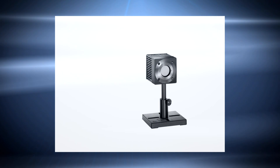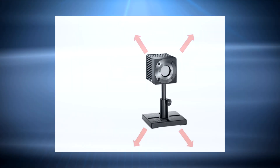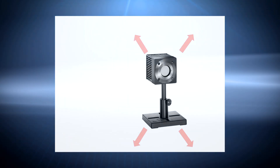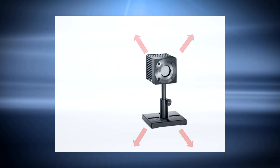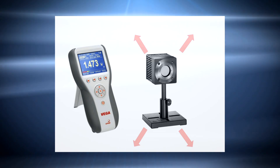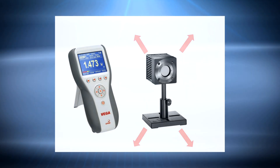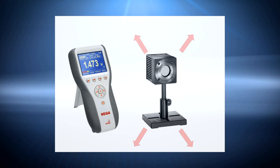If, though, a hot sensor is located in a cool room, then heat from inside the sensor's body will flow outward into the room as the sensor cools down in an effort to reach thermal equilibrium with the environment. This heat flow will introduce an offset into the reading, since the sensor will detect and measure it just as if it were heat flow caused by absorbing a laser beam. In other words, you'll get a reading of power even with no laser beam on the sensor.